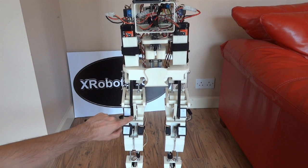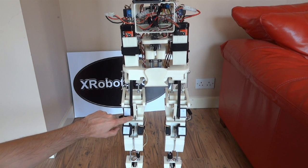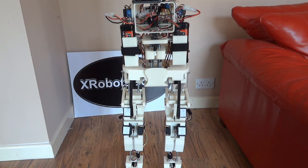So what was happening is the dampeners were getting compressed and the legs weren't moving. I've now levered them right up to move the thighs. It only takes small steps, but it does actually move forwards. I'll show you what it does, and then we'll discuss the way forward for the modifications I need to make.